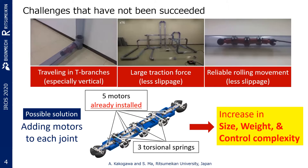One of the easiest ways to enhance a robot's adaptability to branch pipes is by providing an active degree of freedom at each joint. However, this leads to an increase in size, weight, and system complexity. So our idea is that the minimum number of active joints for branch adaptation can be only one if other joint compliance and passivity are utilized.